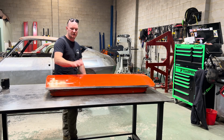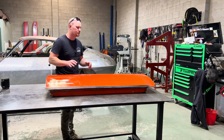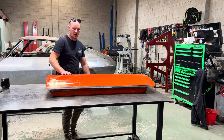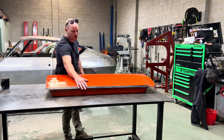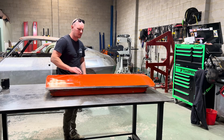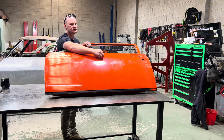First thing, we'll be taking the blank that I've cut out. I've added a little extra material all the way around for the folds. And the first thing is taking it to the wheel. So wheel it up, get a little bit of shape happening in there, and then put a little bit of a roll up in the top here where it's got a bit of a roll.